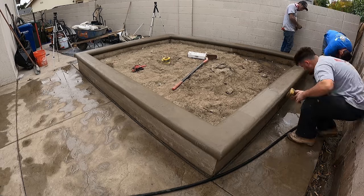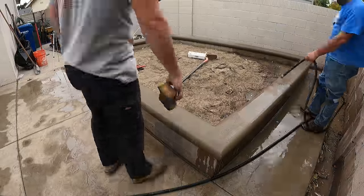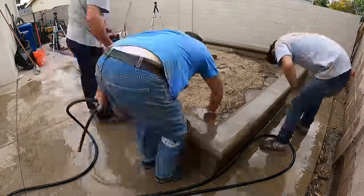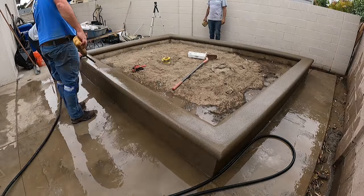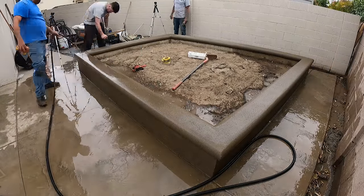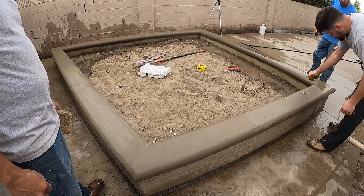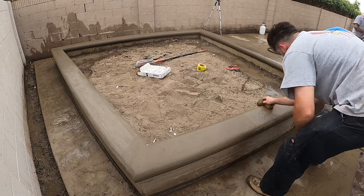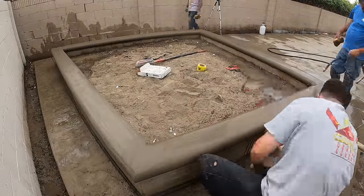You could hit this with some top cast at this point and come back the next day if you wanted to, but I like to have more control over the outcome and take care of it while it's still fresh. Sometimes when you put top cast and come back the next day, it doesn't all come off. This way you can guarantee a pretty uniform result.